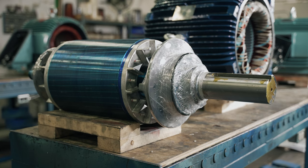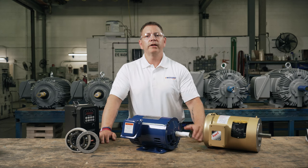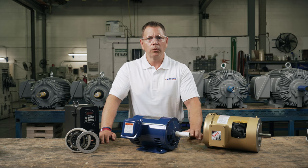Over the years we've mostly dealt with the squirrel cage motor, and that's probably the most common. While these motors are VFD compatible, there are a few ratings it's important to check before installing your motor into the system.